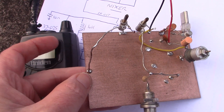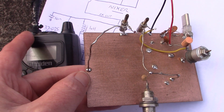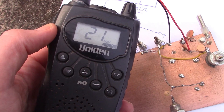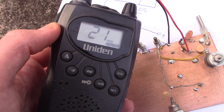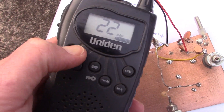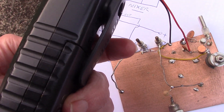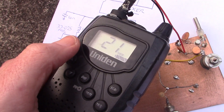But just in case you haven't, then this little unit is a way of receiving the amateur 70cm band, or at least certain frequencies of it, on an Australian UHF CB radio. This is a unit, the UHF040, a popular UHF CB around 20 maybe 25 years ago. It covers the 40 channels as you had then and it's 25kHz steps, uses AA batteries and about half a watt output. But in this case we're not using it for transmit, just for receive.